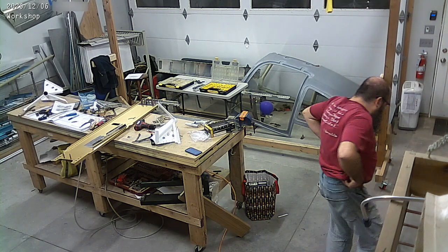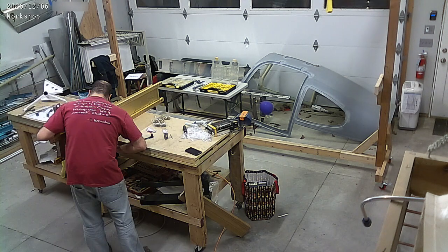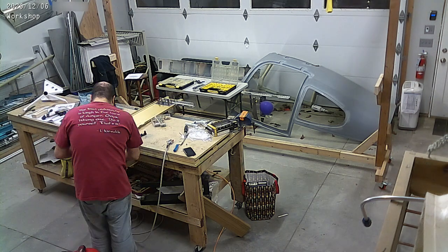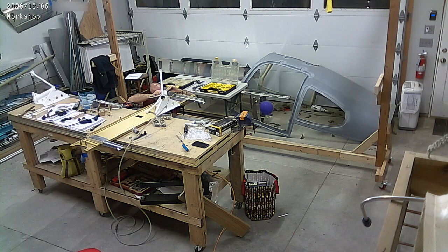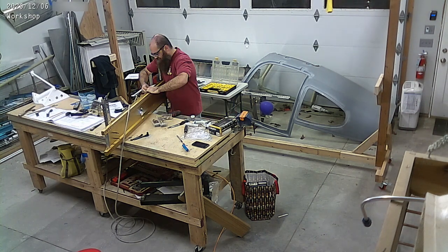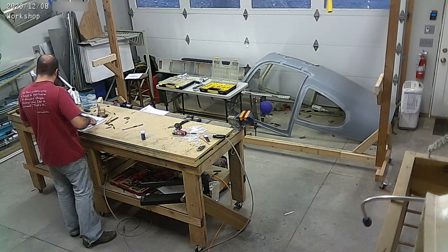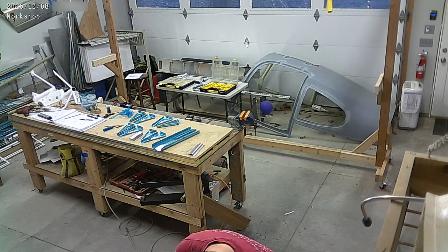You can see that there is the main landing gear — the big white weldments there are the main landing gear — and they attach to that bulkhead, the spar carry-through. Part of it is you need to clean it up. The weldment's got a little bit of flashing that needs to be cleaned up. Some of the powder coat is not perfectly laid down, and there's little bits and bobs of it that need to be cleaned.